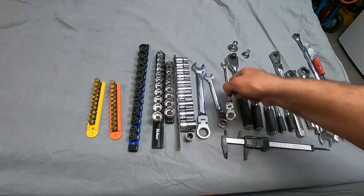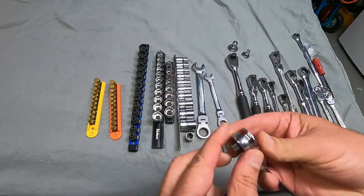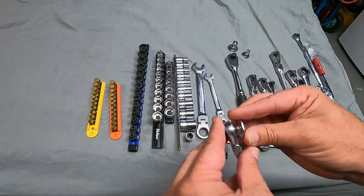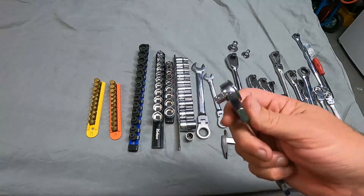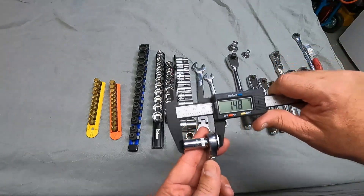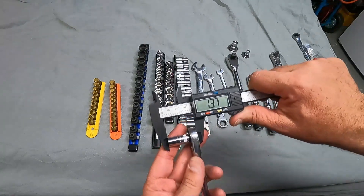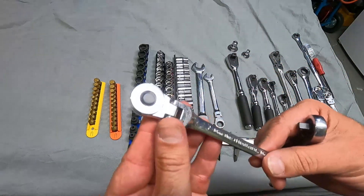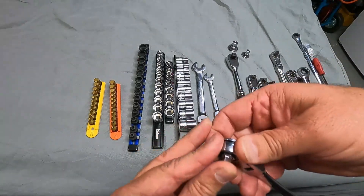Let's take a look at the quarter-inch drive — we're going to be using the 10mm GearWrench. Let's just snap that in. This one's not wanting to fit through there for some reason. Had to force that one a little bit. With a quarter-inch 8mm socket here, we're at 1.48 inches. Here's a GearWrench 90-tooth little quarter-inch drive ratchet — it's actually less, 1.37. The GearWrench ratchet is actually smaller than the GearWrench 10mm ratcheting wrench with this adapter, so that's a little bit of a fail.